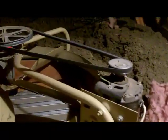In this case today, we've got a whole house fan which is open, as we can take a look down in here and see — open to the whole house. Something that may work to eliminate some of that warm air coming up through here is putting a styrofoam box over the top of it. You just have to make sure to remember to remove it during the summer months when the fan's in actual use.